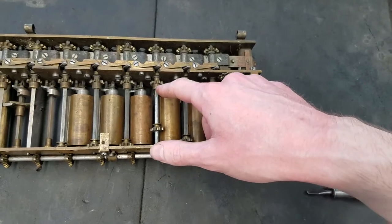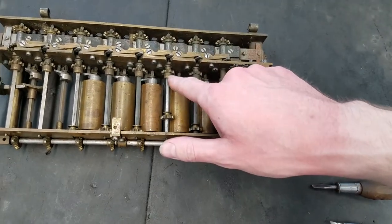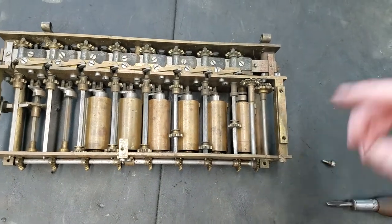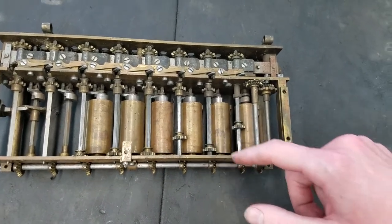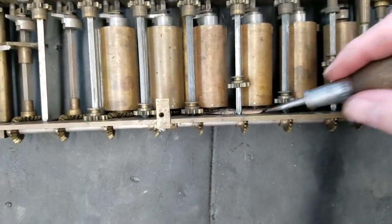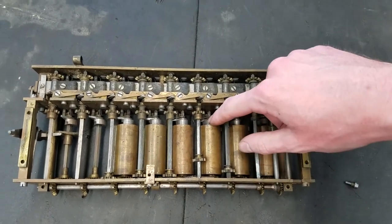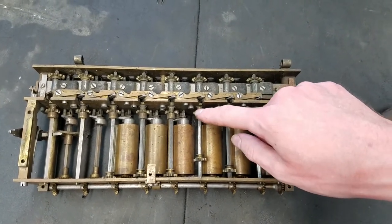Those semi-circles mesh with the outer semi-circles here. The idea is that as soon as you get past the tooth section of the drums, this semi-circle will mesh into the semi-circle in the disc and prevent this shaft from turning any further — just in case you give the handle a good swift crank and these gain some momentum and want to keep going even after they stop being driven by the teeth.